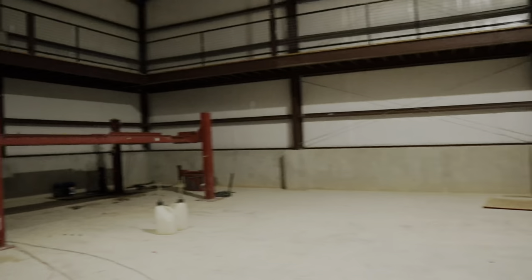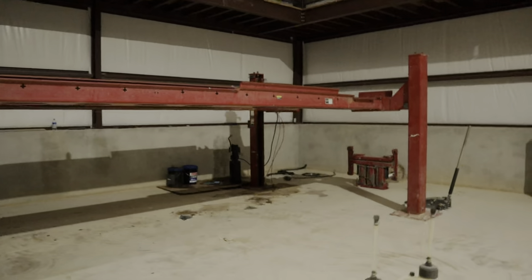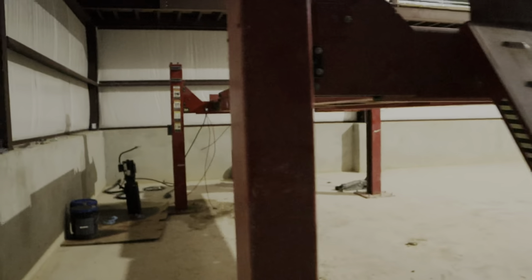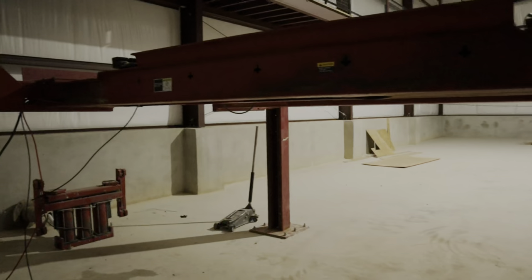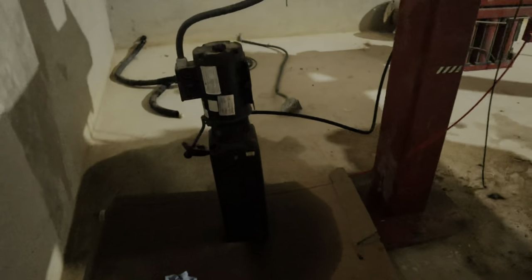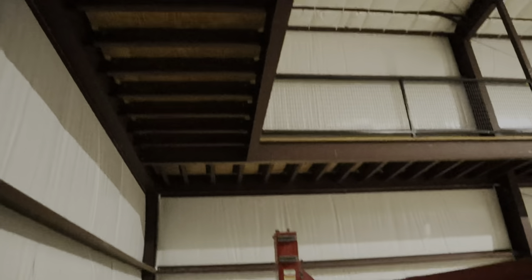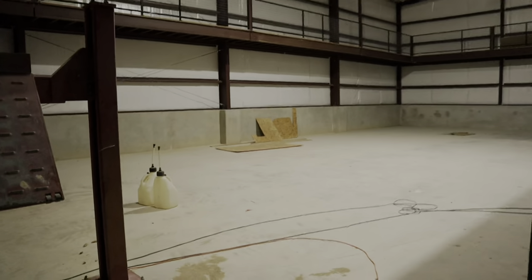Let's open up the shop house and turn on all the lights in this 80 by 60 shop. The four post lift is finally up in the air — we installed it perfectly straight. One issue was that the hydraulic cylinder had a complete leak; I bought the lift used and went ahead and removed the entire cylinder, got it resealed, and installed it back. All I have to do now is mount up the hydraulics, drop a 220 lead off the ceiling to power the lift, paint the lift all black, and add a two post lift in the second bay.